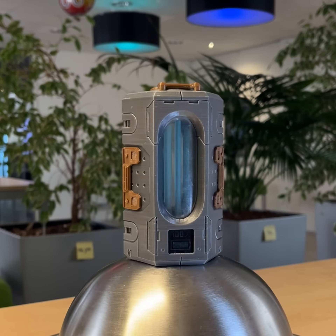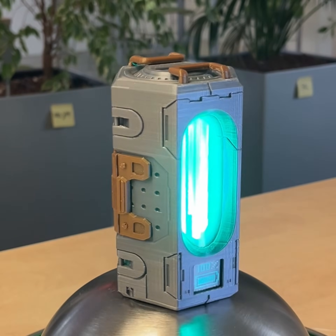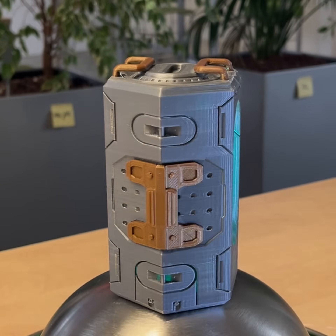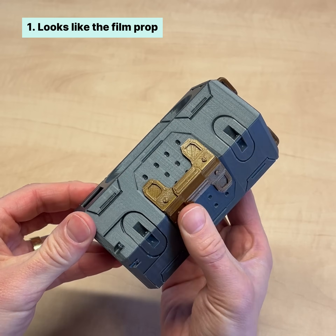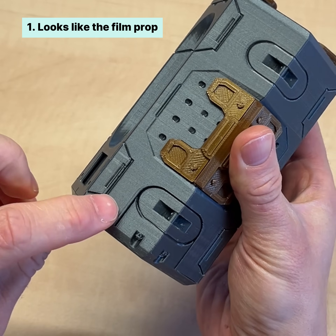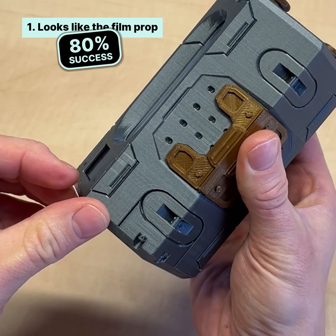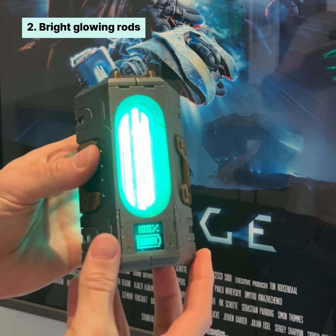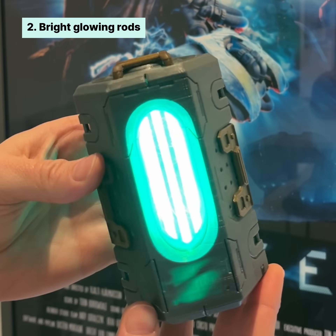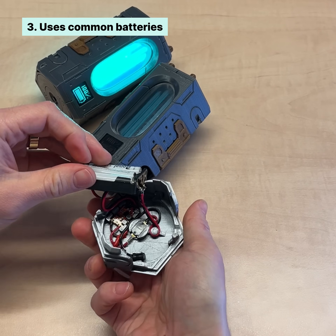This is the first time I ever worked on a product design, 3D printing and electronics, which is evident in the end result. It's full of design compromises and the electronics could easily be improved upon. So let's review my original goals for this project and where I ended up. I had to embrace the 3D printing artifacts from our old printer, but the bronze colored material is a bit off. Also, I had to add a seam in order to access the base, so I'll give this an 80%. With 16 LEDs pointed at the rods, it really looks like they themselves are glowing, but I may have gone too far because they do cause some light bleeding, so I'll give it a 90%.